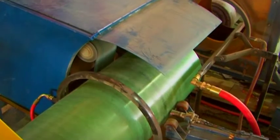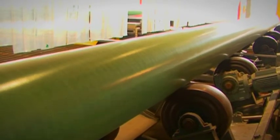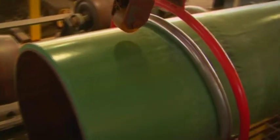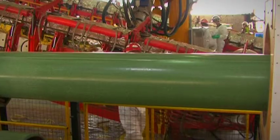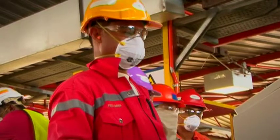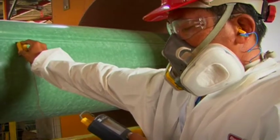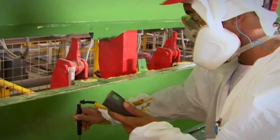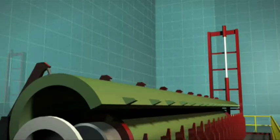The FBE pipe is cleaned and then roughened by light sanding to obtain good adhesion to the insulation. The pipe must be preheated, and this is achieved by induction. The pipe is then lifted into a full-length mold.